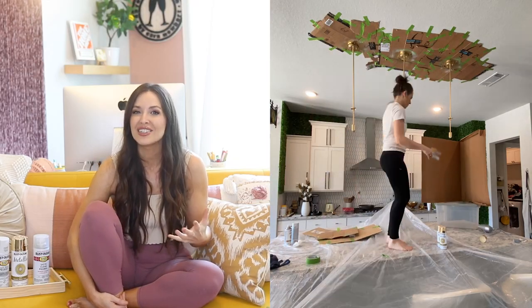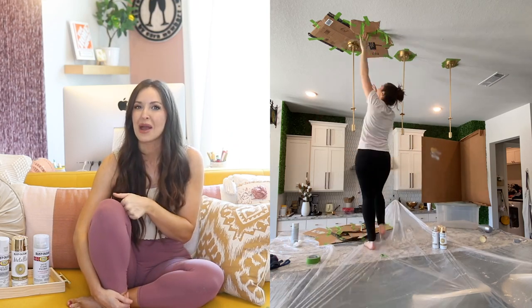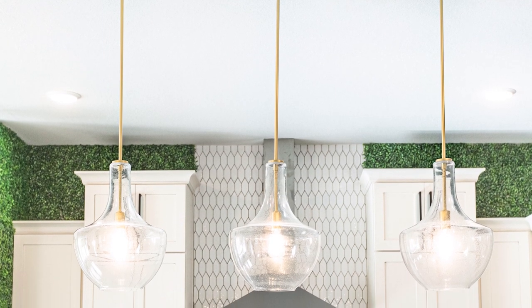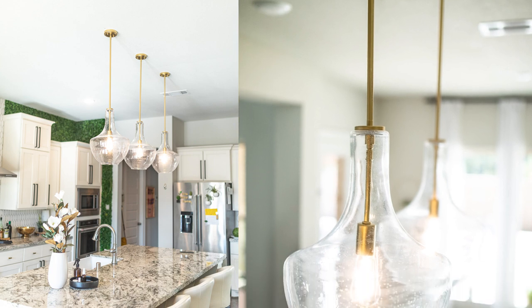Satin is the perfect medium for that beautiful gold finish. If gold isn't your vibe, I'd recommend matte black — it's a really good look that's more moody and neutral. For that, use a flat black spray paint and cover with a matte poly to seal. Now it's time for the big reveal — wait till it's dry, take down all your prep materials, and you're left with gorgeous gold light fixtures. A couple of $6 cans of paint fully transformed these. I didn't have to buy new ones and I absolutely love the way they turned out.